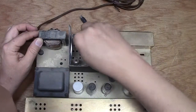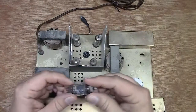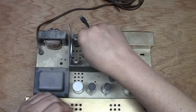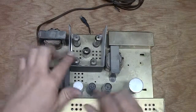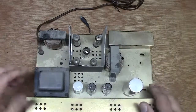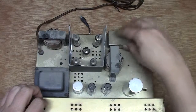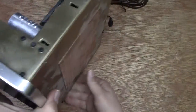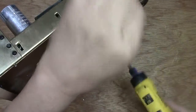We'll take a look at what's going on with the output stages here, because these are the 6AQ5s, and this one here is, what is it? This is the driver. The driver triode is probably the phase inverter for those guys. Okay, here's the preamp tubes. They're shielded, and this is actually shielded as well. Output transformer, power transformer. Here's the caps here. And there's shielding around the input connectors on the back. So down the bottom, let's take a look at the capacitors here.